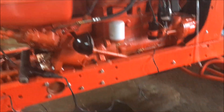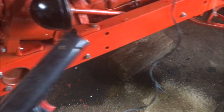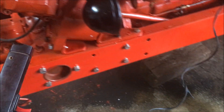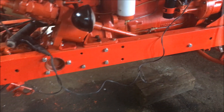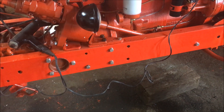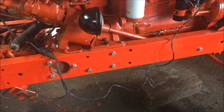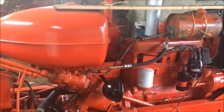This thing's running pretty good. I got it timed — I haven't used my timing light much lately, I used to use that all the time but I've used it probably twice in the last five years. Anyway, the timing mark is on the flywheel, you access it from down below. When I put it together I put a chalk mark on the 20-degree advanced position where it's supposed to be, so you can see it easier, and that worked out all right.